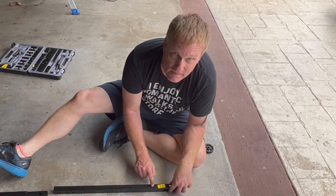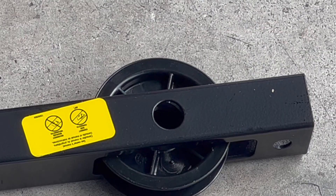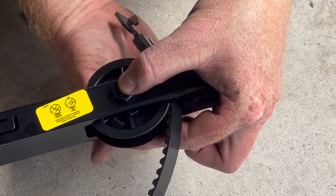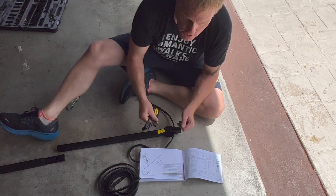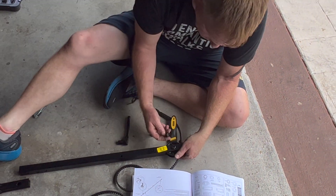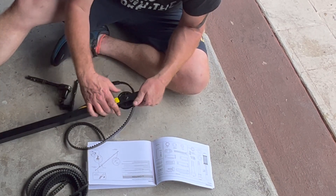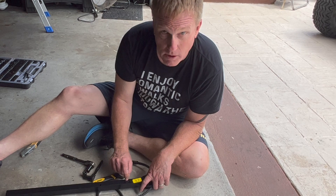The big hole is up and this tab is up as well. Go ahead and put the pulley in. It says to pass the last 12 inches of the belt through the window, then tighten this down. Just want to make sure the pulley spins freely — it does. Now we're going to bend this tab up 90 degrees.